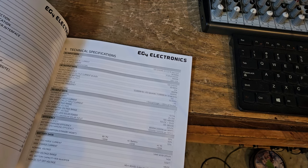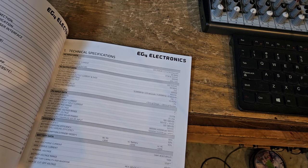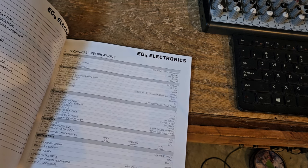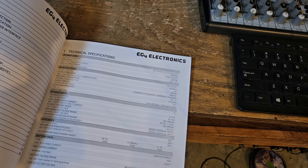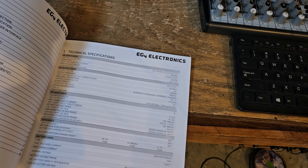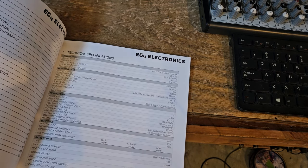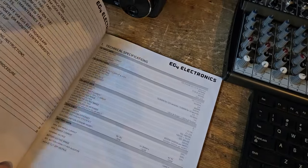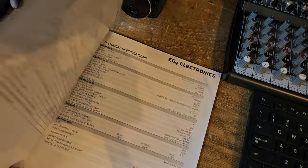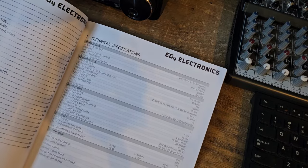So this does 120 and 240 volts, which is a pretty big deal. 37.5 amps at 240. AC bypass grid, 50 amp. So max continuous current at 240 volts, 25 amps. So it's not 37.5. Okay. This thing is so brand new, it doesn't want to stay. So what I'm looking at, because I'm probably gonna have to reconfigure my array.